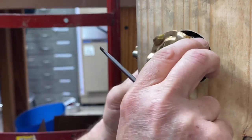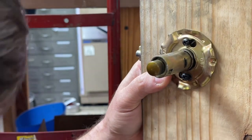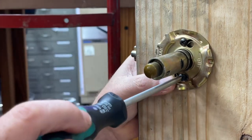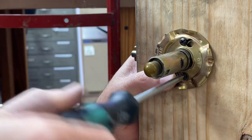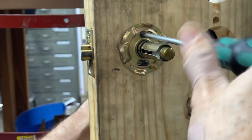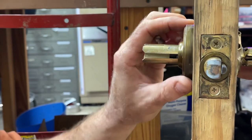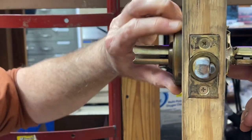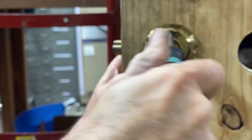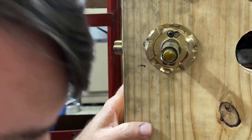Make sure you get it in the grooves. We're going to put this back on before we rekey, so that is how you take it off and put it back on — it can be a little tricky. Tighten this back down and be ready to put our outside knob on. The outside is adjustable — if it's still loose, your outside trim is adjustable, kind of like a commercial door lock. If you screw it down it'll make it tighter for thinner doors, so a thinner door would need to be screwed down a little more than it was.